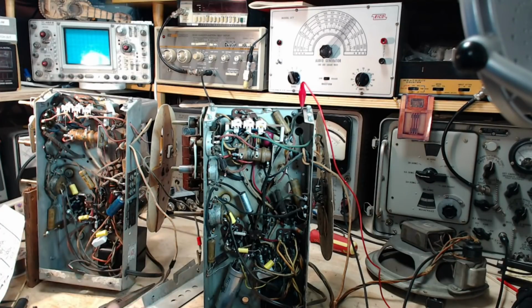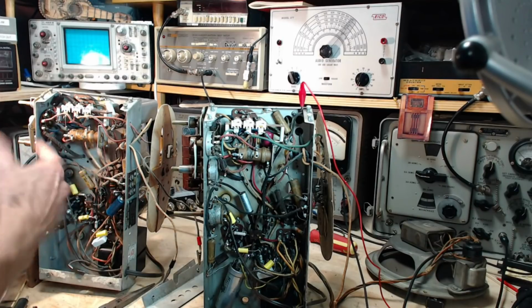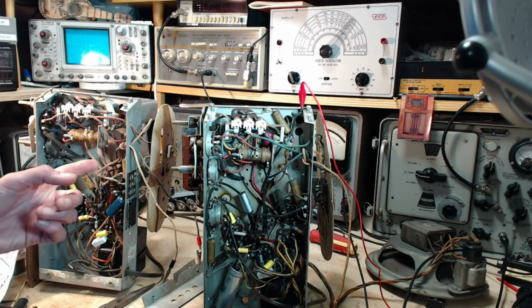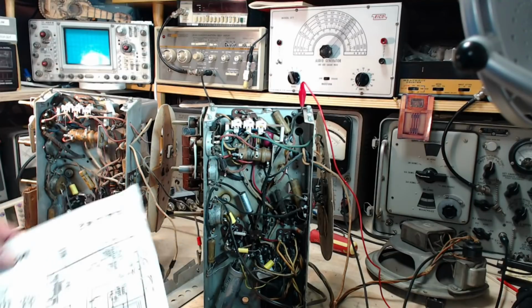A capacitor to ground is usually draining something out of something, like draining signals you don't want on the AVC line, draining them out to the chassis. If you drain them at the other end of the wire, then those currents, if you like, could be traveling on the red wire now. Whereas with the capacitors up here, it could be draining them out before they get to the red wire. You kind of follow what I'm saying? That makes the red wire either an antenna for radiating or an antenna for picking up. Any of that true? I don't know. Sounds great to me, though.